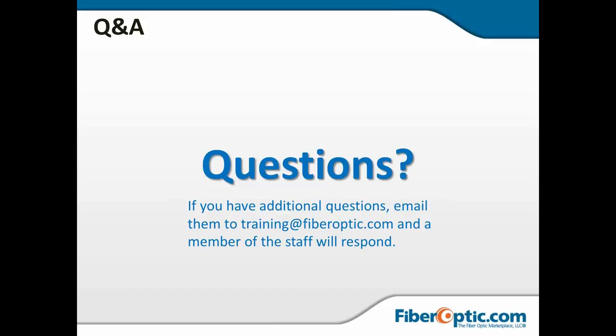And let's see, another question, how difficult is it to correct a non-reflective event with high loss? It's not difficult at all. You break it and resplice it. Now, there's nothing to be done about correcting it. If you do a burn and it's got a high loss, you've got to break it and resplice. That's all there is.